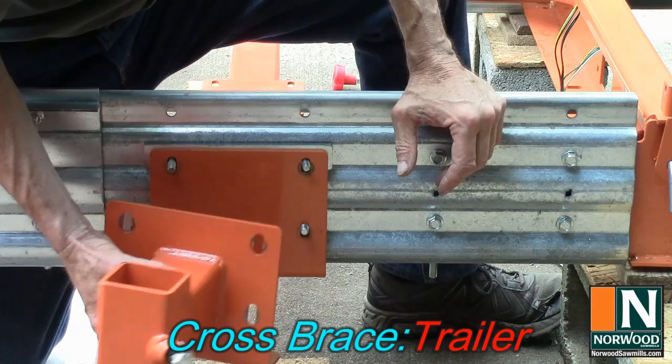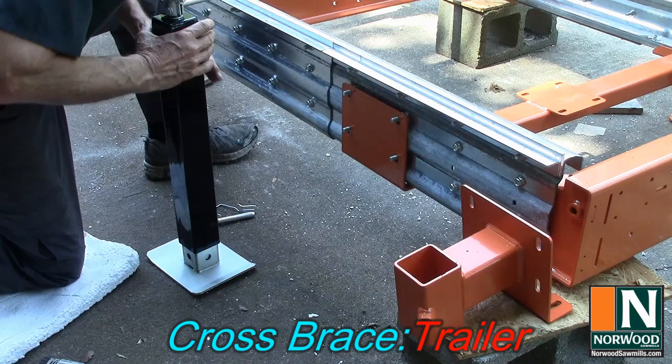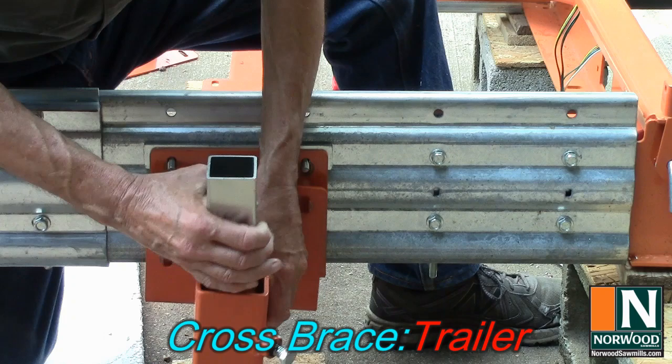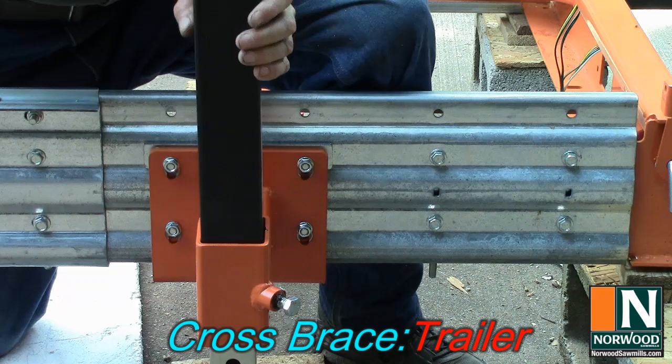Now, I've learned through trial and error, mostly error, that once a jack bracket's bolted in place, there is no way to slip the jack in place. So you might as well save yourself the trouble by taking the jack apart and slipping it into the bracket before you bolt it onto the frame. More nuts, again, finger tight. Reassemble the jack